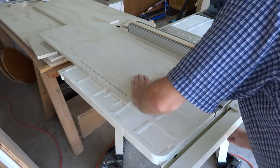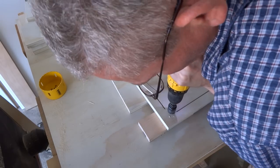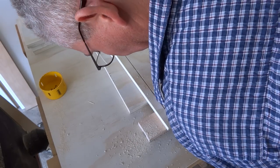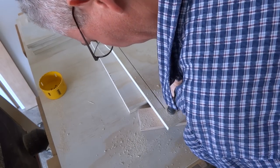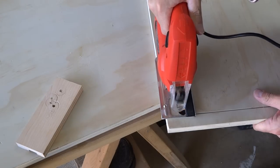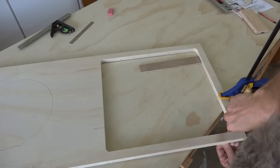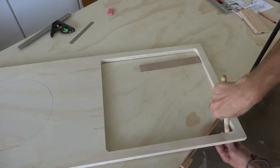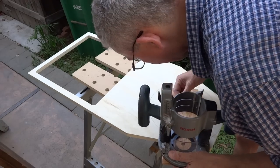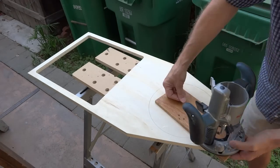I rounded all corners as per the plan, however for the inside corners I did not have hole saws with the required diameter, so I just made do by using the closest matched hole saw that I had. I used a router and made a simple circle cutting jig to round over the outside end of the top base piece and to cut the inside hole for the bucket.